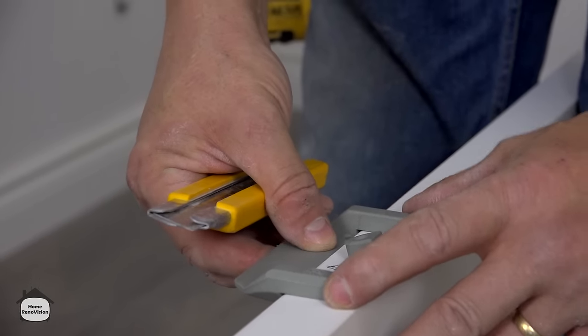This is a three-inch hinge and you'll see it is not mortised to the same detail — I bought these hinges in the same store as the jamb kit, but you'd think they would source products that match each other. They don't — they let it become your problem. If you're having any trouble, it's easy to patch this stuff up afterwards with a little bit of drywall 45 compound.